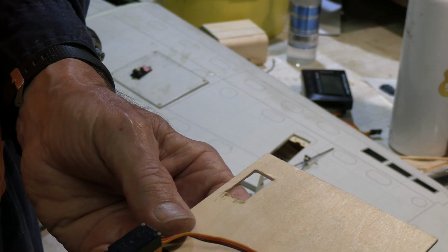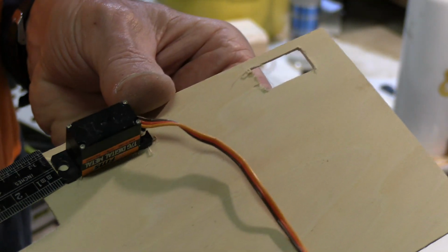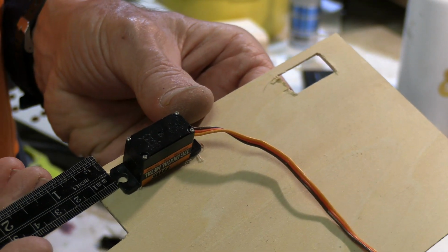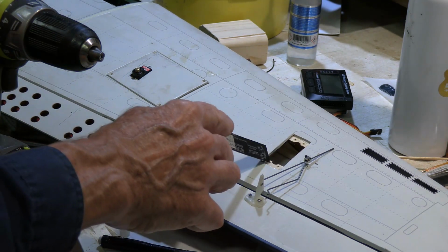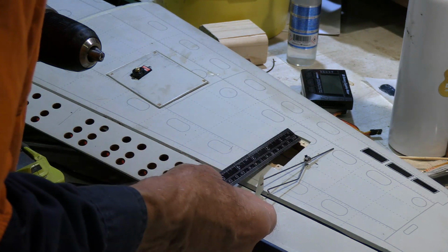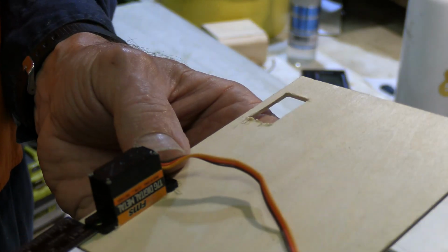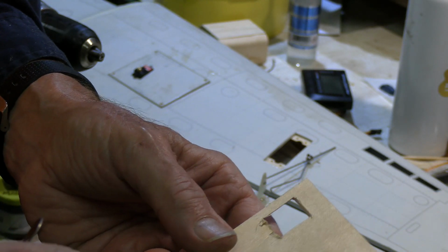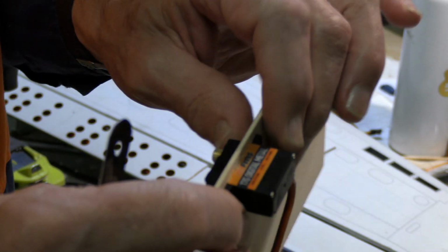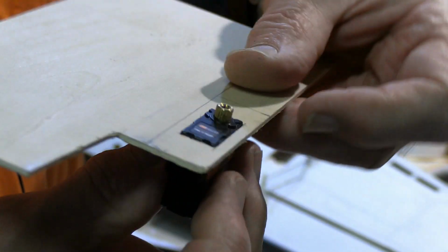Okay, so the spacers are just simply going to be underneath the tabs on this, because we got to come out 9 millimeters to get to where the bit underneath is that sticks out. And it's about the same on both. This is slightly under 9 millimeters, and this is slightly over 9 millimeters. So we'll just simply make very small tabs that go under that. That will allow that to be spaced out from the back to where the top is even.